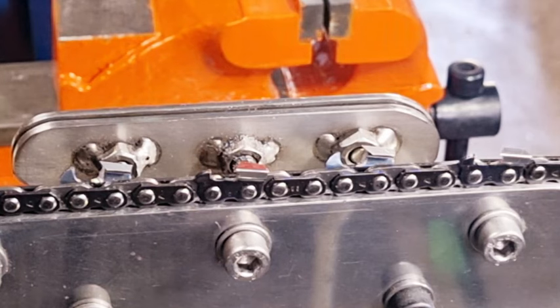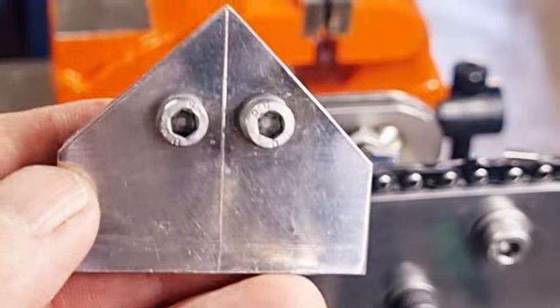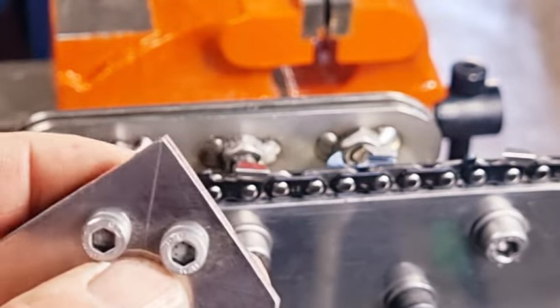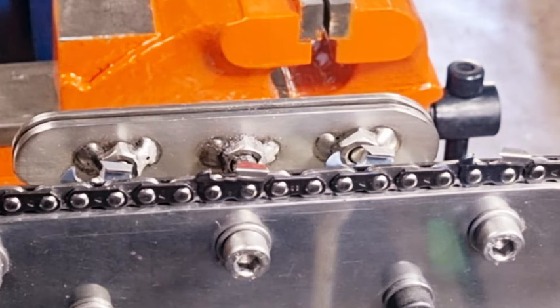There is another chain type that is even worse than grinding Hexa as far as accuracy is concerned, and that's square ground. You can get a little jig — this isn't the exact jig, this is one I made — where you put your chain on and shape your grinding wheel for square ground. The problem is you've got to constantly reshape the wheel, and you need really high quality wheels. It's not something I think will ever take off because there's a lot of mucking around.